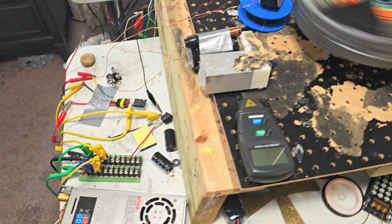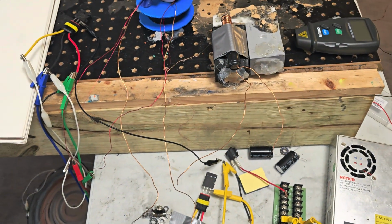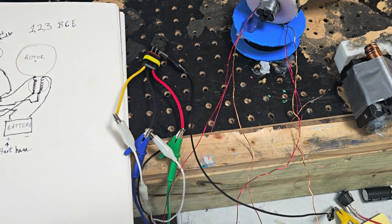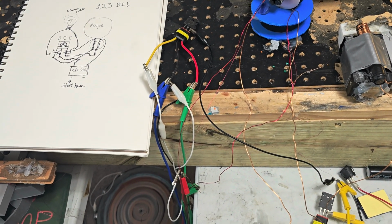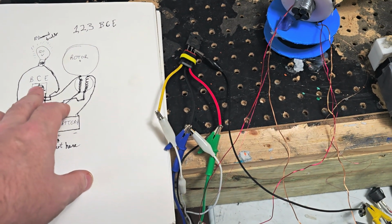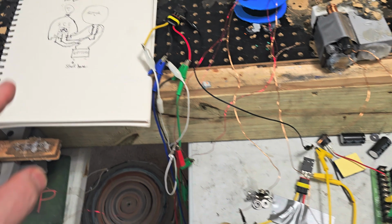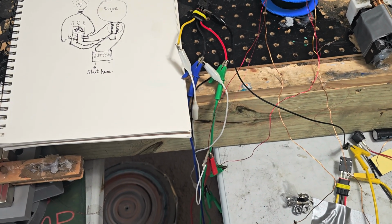All right, well, there's just a few things you need to set this up. You need 2 transistors. You need to make those legs a little bit longer, have a little bit more room to clip. You need to clip the base to the first one. Your transistors have to be in this order for their pins. It's got to be BCE in order for the directions to make sense. But once you get the pattern down, you can flip them, flop them, whatever you want. Doesn't matter because you know where to put what.